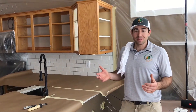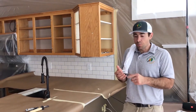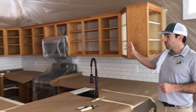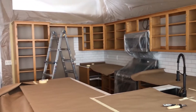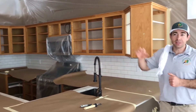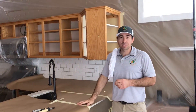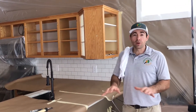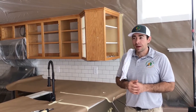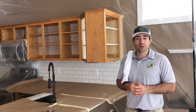It happens to be oak cabinets and what we're doing is going to be done in multiple stages. Step one, we stage. If you take a look around here, we've removed all the doors. We've covered all the walls, used zip wall poles to protect adjacent rooms from where we're going to be spraying. We've covered the new countertop and covered all the floor — generally two layers of paper with a layer of plastic in between, so we protect 100% of the homeowner's stuff.